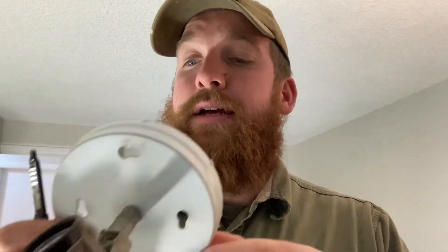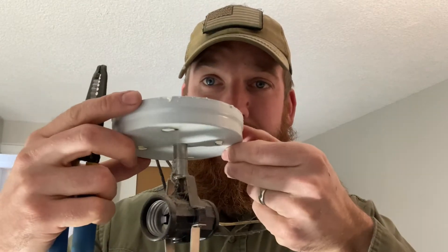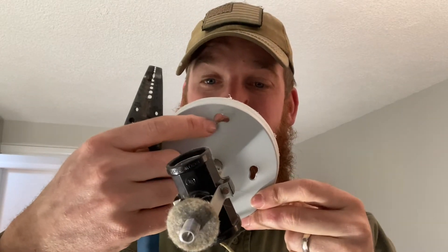So we got the old light fixture down. If you're wondering why I was tossing glass light bulbs and glass covers, it's because I have a bean bag on the ground so I was able to catch them. That was just a matter of loosening two screws and then turning it to make the holes line up so it falls out, and then we cut the wires. White one is neutral, black one is hot, and the ground is up in the box so we'll have to tie the new ground into the box. We're going to keep those screws there because we'll use the new fixture, tighten the screws down to hold it in place, and then start mounting the ceiling fan.